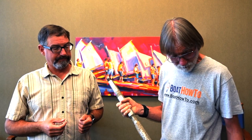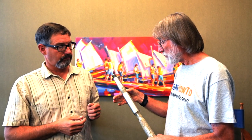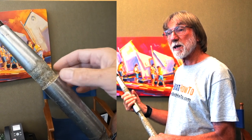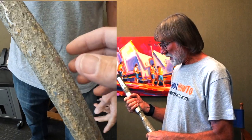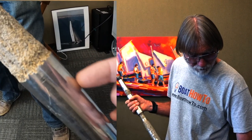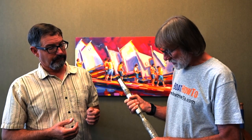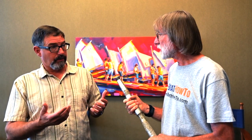We've got here a prop shaft riddled with stray current corrosion. We must have had the propeller on here — you can see where it ended. So there's no water in here because the propeller's tight. This part has to have been in the water. Then we're assuming there's a strut here with a cutlass bearing — so we've got a rubber bearing. The strut is probably bronze. Then we get into the water again; it must have been a long run up into the hull. Then the shaft is sealed, so we're out of the water again. The entire prop shaft everywhere in contact with the water had to have been feeding positive current into the water, most likely to the strut.